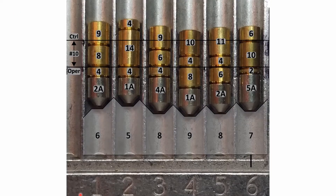Here's yet another possible operating configuration where I've lifted everything above each master pin, so the key cuts would be six, five, eight, nine, eight, seven to open this lock to operating. Notice in chamber six, five plus two gives seven, and with the number ten control pin in there that gives us both the control and operating shear line at the same time. This slide shows there are many possible ways to reach an operating shear line — but how many ways are there to reach a control shear line? We'll look at that next.